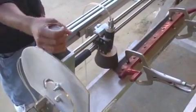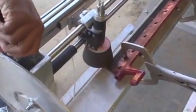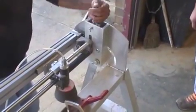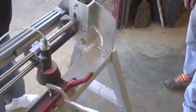Beginning on one end, adjust the stone until it slightly touches the bed knife. Move the stone to the other end and adjust the stone until it slightly touches that end of the knife. Take it down to the scrubs.